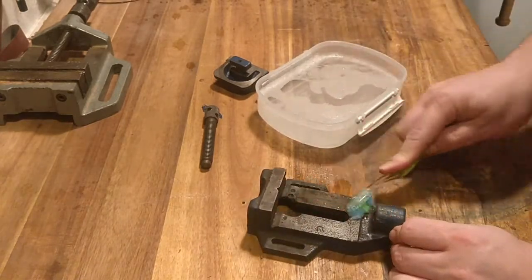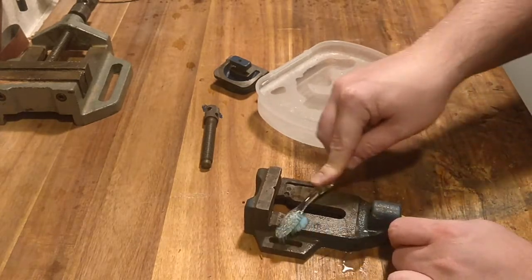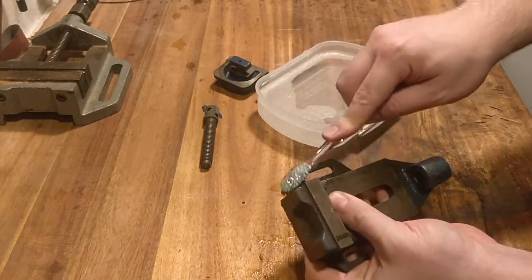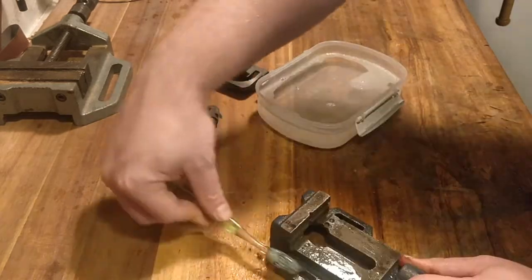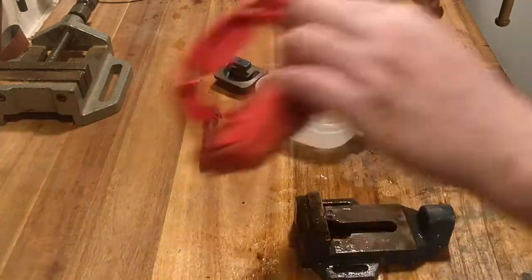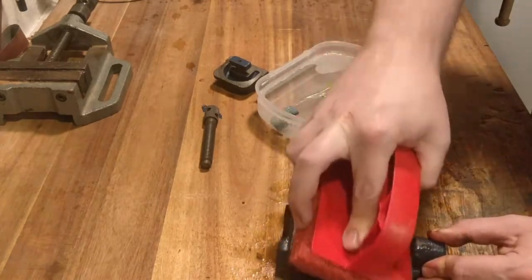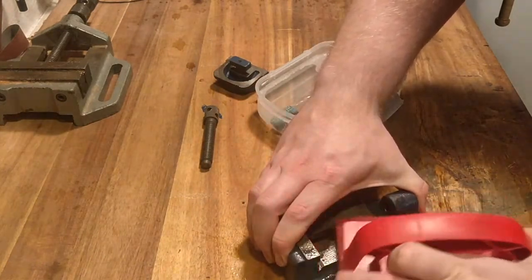So I start by cleaning the most simple dirt and grime with some soapy water, just getting in everywhere, removing as much dirt as possible. And at this point I realized that the dirt I get away is fine, but the main part is actually grease. So I switched to a degreasing agent instead. But before I switch to that, I try using some abrasive fabric, some Scotch-Brite I have. Scotch-Brite is in general really good for cleaning without damaging components, especially something that has to stay flat.